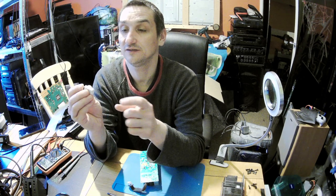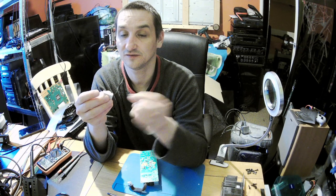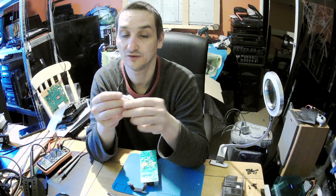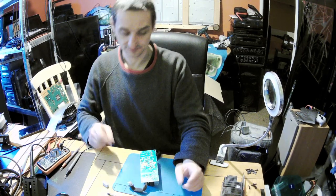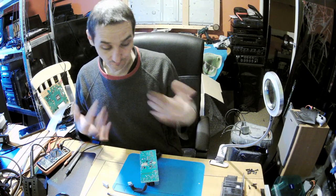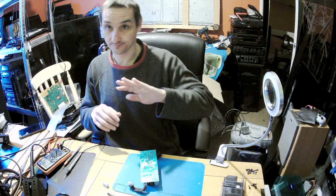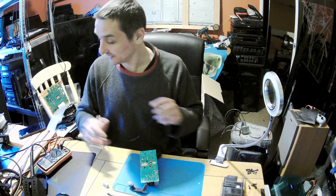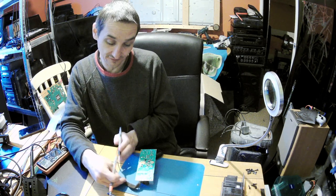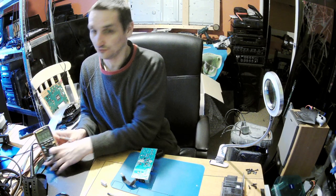If they've got like an inlet here, outlet here, well, they don't have that, but you know, like wire from one side and second, then you can put here, twist them together and then touch those sides of the component and discharge it. Don't touch it. It's really dangerous. Now, as I work with them all the time, when you touch it first time, you should do it like that as well, if you don't want to have something blown in your face. So, as you can imagine, if we get volts here, we've got none. Yes, so that's what I did, and that's what I've seen, no volts.